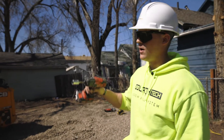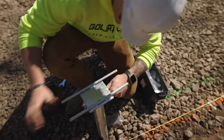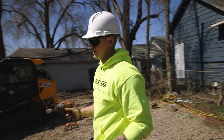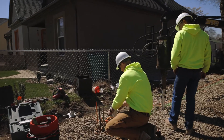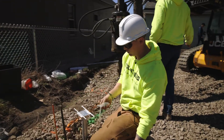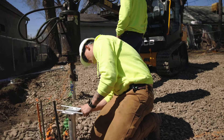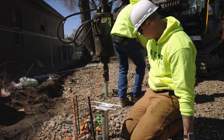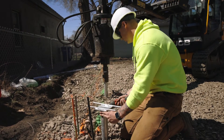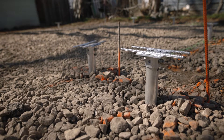What I'm doing is following them as they're installing the piles, staging the rebar heads at the locations, and then installing them as I go. Basically I walk over, put the rebar head on top of the pile, and then put a bolt going through it so it has uplift and down resistance. I throw the bolt through, put the nuts on, tighten it up — and that's all I have to do to get these rebar heads on. This is the final step. When we leave here today, all it's going to be is these piles with the rebar heads all the way around the foundation so when the concrete guys come in they can tie onto the rebar and they're ready to go.